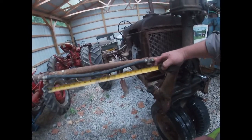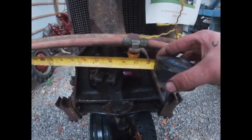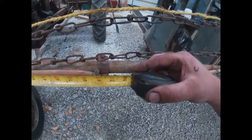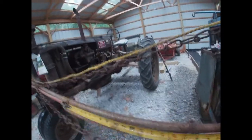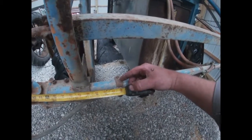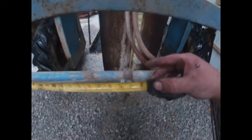In order to get this to work right we need our nozzles on 20-inch spacing. Measuring along the boom — there's 20 inches, not quite but pretty close, within a quarter inch. That one's within a half to a quarter of an inch. Yeah, we're pretty good on all of them through the boom. In the center that's 21 inches — it could be moved a little bit, and then this one here is sitting right at 20.